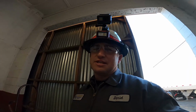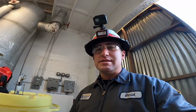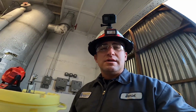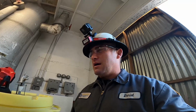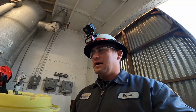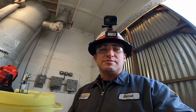Survived a little ammonia leakage on it. This is what I'm filming with right now. Ammonia started spraying on it, and I had to grab it. I didn't realize it was going to come out the top as strong as it did. That's why you wear all your PPE doing this. You can put a tube on it and direct it somewhere else, but every time I've done that, it flung around, it could hit you in the face. Just have nothing on top, it just kind of sprays up a little bit.